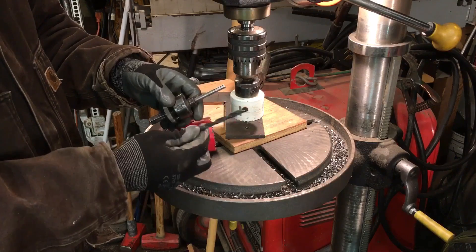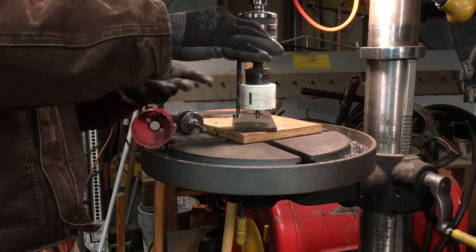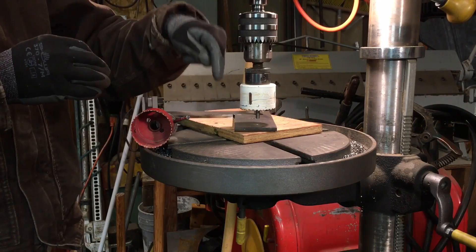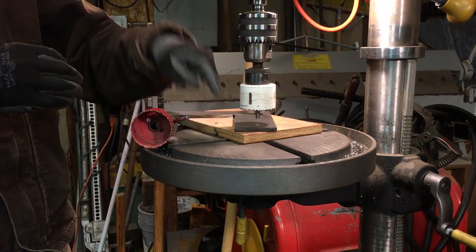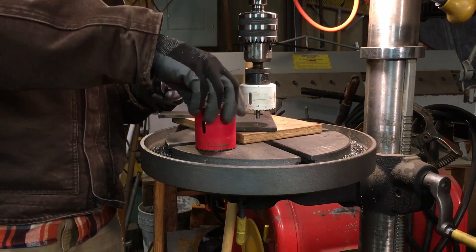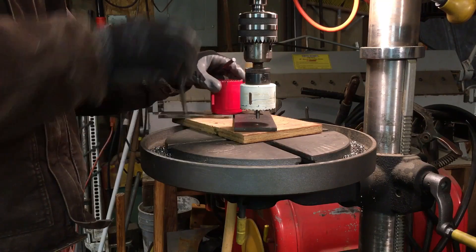Normally this has a quarter-inch pilot bit inside, so you have this scenario where the quarter-inch drill bit sticks out below the teeth of the hole saw enough to drill into the surface you're drilling. It drills a hole, stays in that hole, and guides the hole saw down. Because if you don't have that, you hit with the hole saw and it chatters around like that — just chews a mess into your work rather than a nice clean hole.